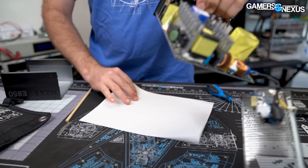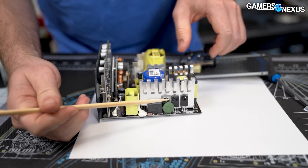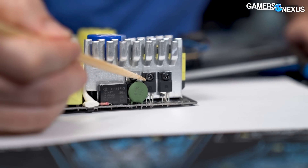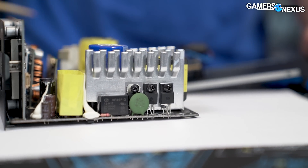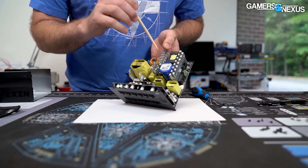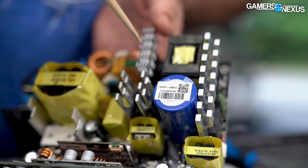Let's get some better contrast with a sheet of paper. The APFC MOSFETs are right over here — these two little guys. Usually when MOSFETs blow they split right across this part of the package, but these guys look just fine. So it wasn't those that made the magical wonderful-smelling smoke. Looking at the other two MOSFET locations right here — those guys also look fine.